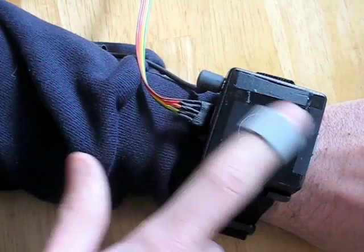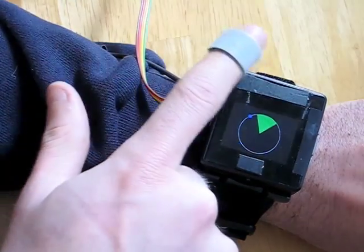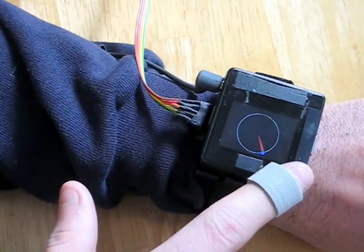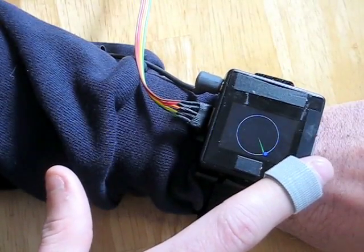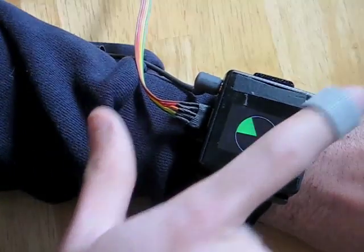We achieve this interaction by employing a 2-axis magnetometer operating behind the display, and a small magnet which is worn on the finger or potentially integrated into the tip of a stylus. This configuration provides a high accuracy and wireless means to interact with very small devices. Furthermore, magnets can penetrate occluding materials and never have to be recharged. I will now talk about some of the example interactions enabled by our technique.